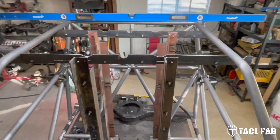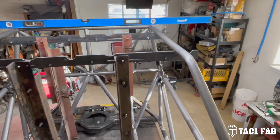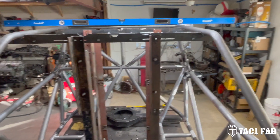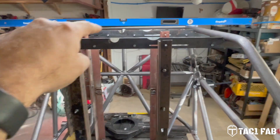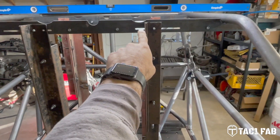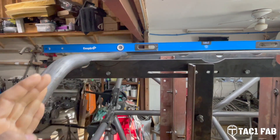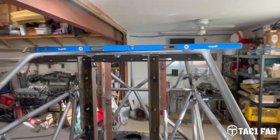That's going to go across the top. There's one that goes from front to back down to the brow tube, and then there are some diagonals that go from the center back up to right here at the A-pillar support. And then there's another one that goes on both sides, so they're symmetrical. The one thing I didn't do — and I didn't even think about it when I was designing these fixtures — is I have a relief in here for those diagonal roof brace tubes. This relief is meant for the back. This one in front is not going to work because they come out to this area here. So what I got to do is take a grinder and modify these, because this area right here needs to be relieved so that tube can come in through here and butt up right behind this brow tube that goes across the front.